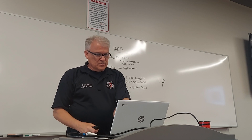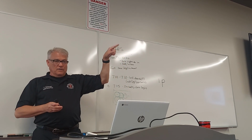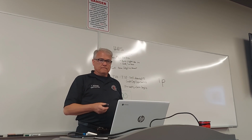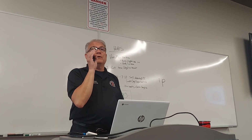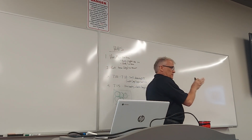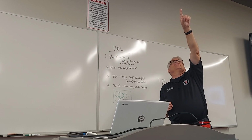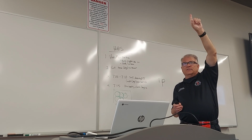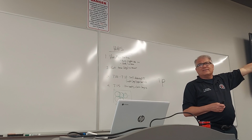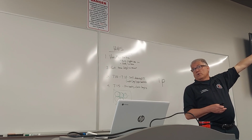Sprinkler storage. There is going to be a sprinkler storage cabinet, usually where your main control valve is in the sprinkler room. You're going to have a minimum of one type of sprinkler head that's found in the occupancy. So if this room has these heads, there's got to be at least one of those in there. And let's say another room has a higher temperature head near the flammable liquid storage or something like that, then we're going to have one of those in there.